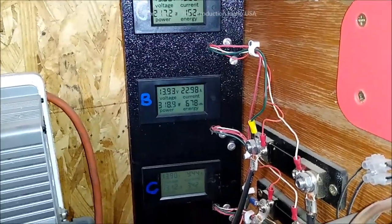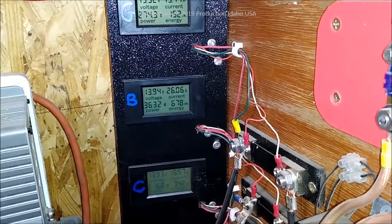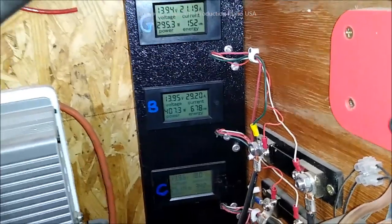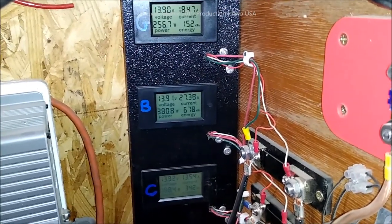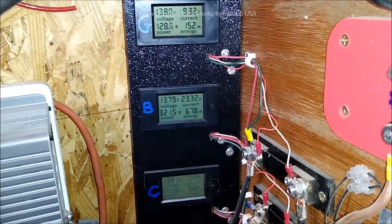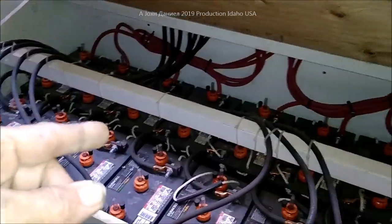The winds are probably dying down — it looks like it right now. Bank voltage is coming down a little bit, but I wanted to catch that to show you guys some peaks. You just saw 1100 watts — I didn't even catch it in my video, it might have been higher than that. Look at those amps coming out — I think it hit like 90 amps. When you're charging a battery bank this big with these big monsters, you need wind power; solar can't always do it all. All right, me and the guys are working on new projects — some repairs, a lot of classic old stuff. We've got a project next.